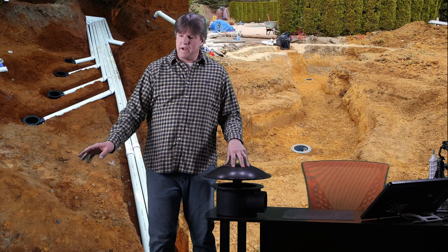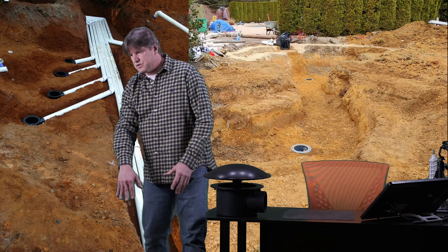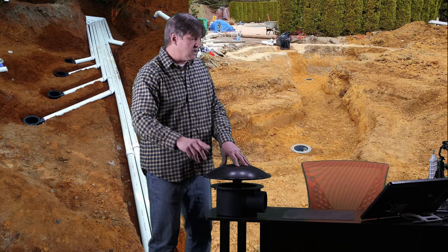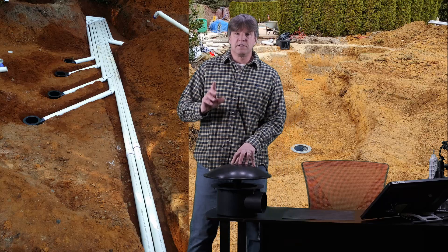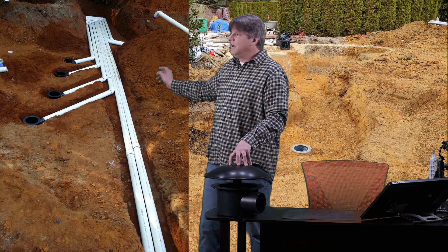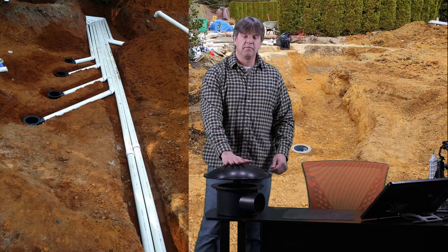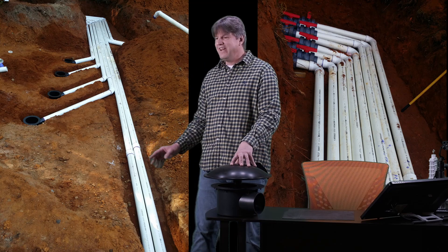Once we get to the edge of the pond, we go down on a 45-degree angle, keep the trench back a little bit, go down that 45-degree angle, get to the bottom, do another 45-degree angle, then a straight trench out to the center of our pond where we'll put the bottom drain. Really important: we start our plumbing at our fixed position — the filter tank — and run plumbing all the way back to the pond, down to the bottom, and across to set our bottom drain. Make sure every joint is glued nice and tight.